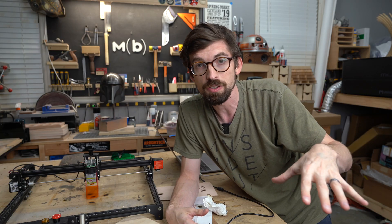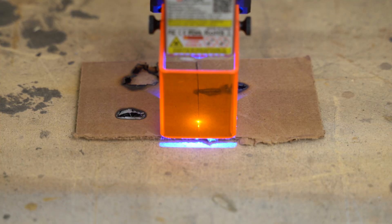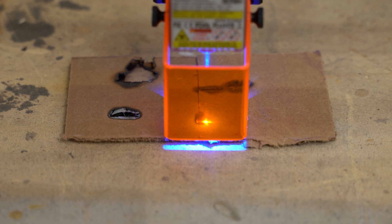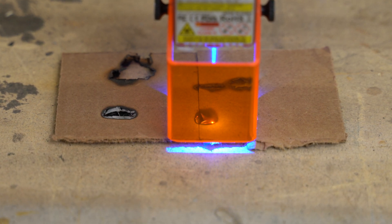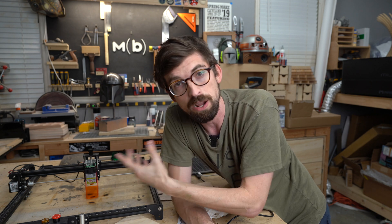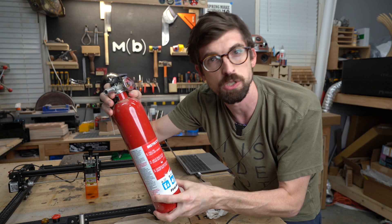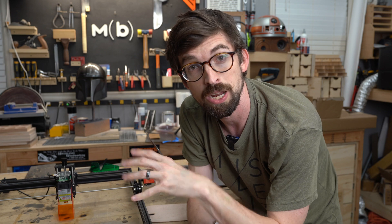So you might have come into this video to see what I was going to catch on fire, or if I was going to hurt myself or burn down my shop. Hopefully the real takeaway is that you can see how quickly a flame up can happen and how conscious you need to be of being safe. There are really three different things you need to be thinking about in terms of safety when you're running a diode laser or laser of any type. First, what are you going to do in the worst case scenario? What do you have this set up on top of? What's around it? Do you have fire extinguishers and safety equipment? If a flame does happen, can you get that flame out really fast? A real fire extinguisher is going to be your best bet — you'll definitely ruin whatever you're trying to engrave, but at least you won't ruin your entire shop.